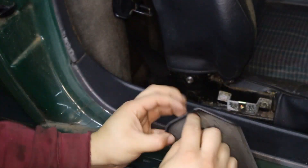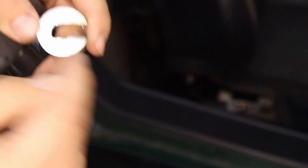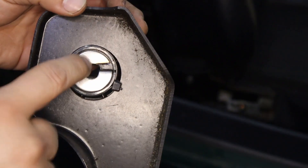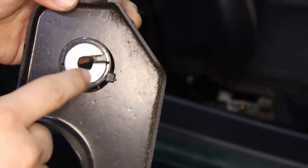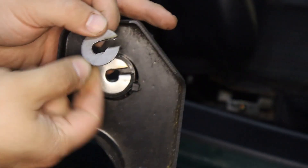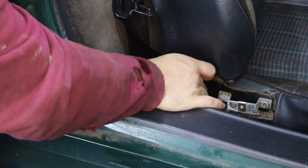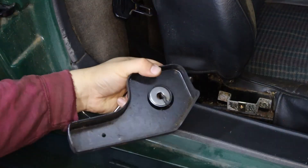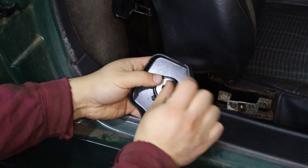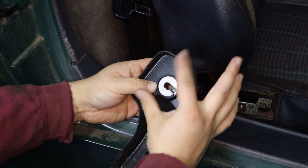I forgot I had the wrong washer — I need to go get the other one. So I've got my correct washer. You can see this has been flattened on both sides, whereas the one that doesn't work was only flattened on one side. What went wrong was I used an M8 washer and an M8 hole is too big, so I had to find an M6 washer and file the insides until they fit accurately. I've got the washer in place, now putting back the zip tie — that adds a little tension but more importantly stops the plastic from opening up.